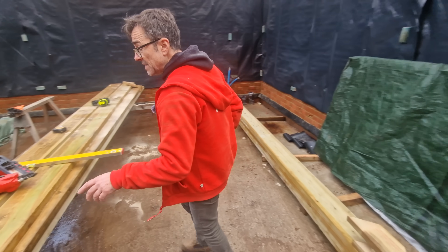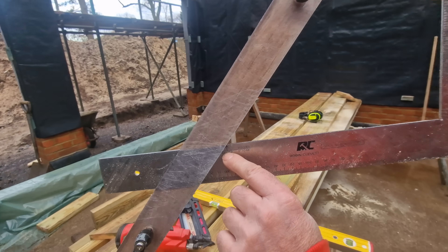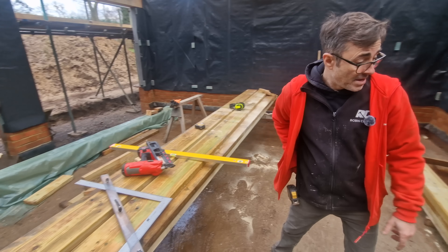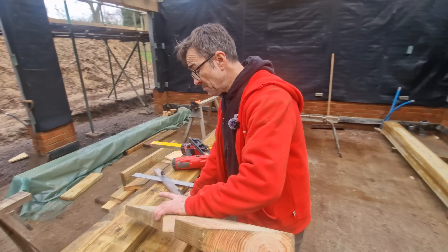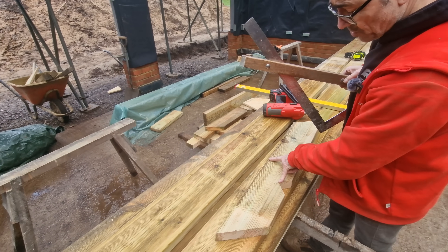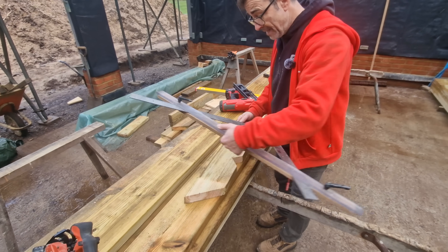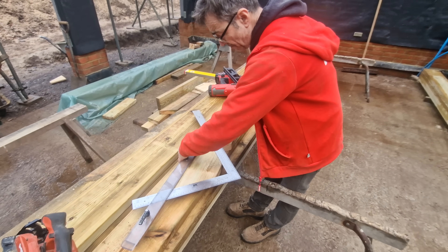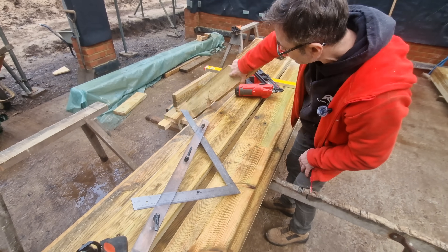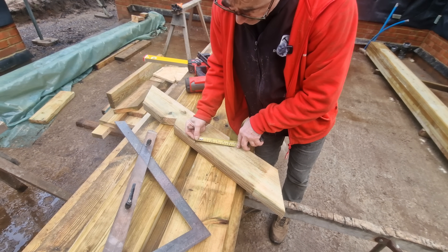The first thing we'll do is cut the feet for all of the hips. To do that it's fairly straightforward with a roofing square. This is currently set up for the rafters — there's the rafter position here and 50 degrees, which is what the roof pitch is. I just need a measurement from one of these rafters first. It all revolves around having a bird's mouth that's two-thirds, but to transfer that onto a hip you mustn't measure square because it will be wrong. I'm going to put a plumb cut — a 50-degree cut — on the back of what is the bird's mouth. I'm going to measure that mark and write it down — that's 153.